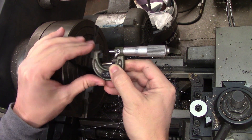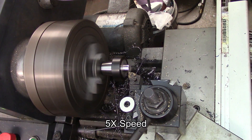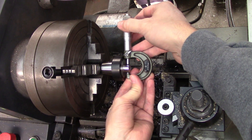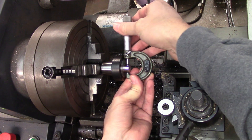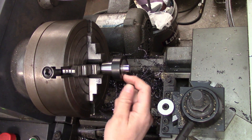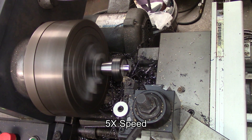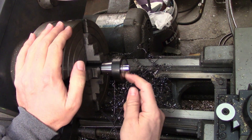I'm at about 653 right now and I'm shooting for 619. We're just a little under 620 thousandths, which is within our range for major diameter — so we're good there. I'm also going to go ahead and make a light facing cut here so that it meets up nicely on the boring head.